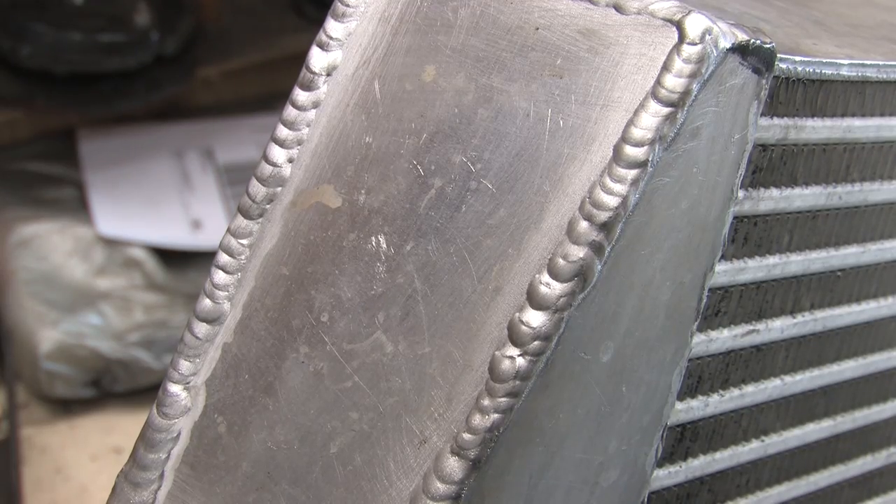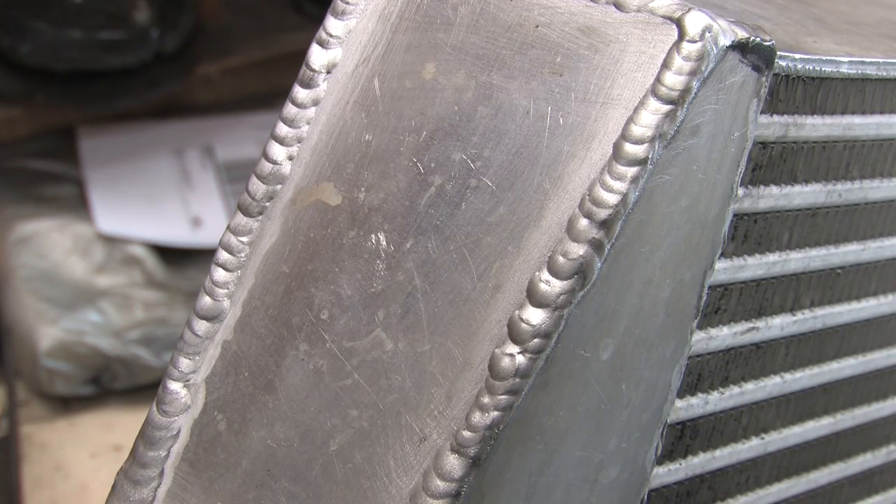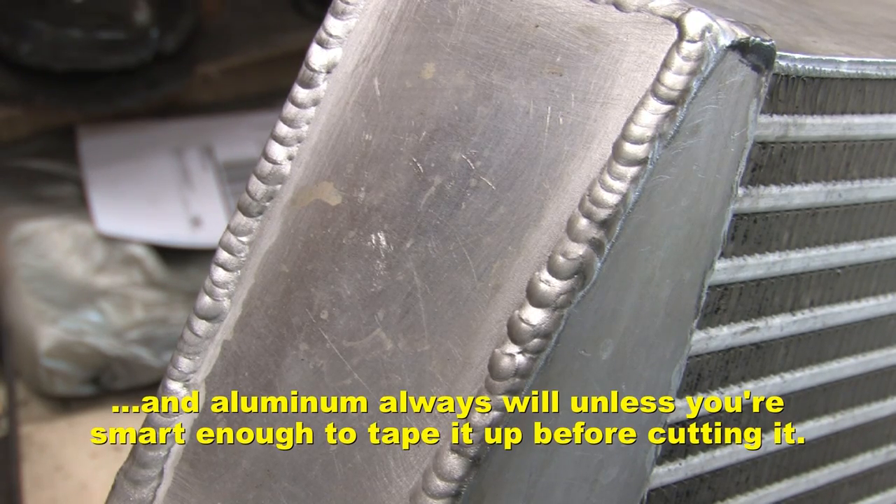The first thing is where to start. When you have a piece of aluminum that's marred up and you want to put a nice shine on it and get all the defects out of the surface, what you have to do first is figure out what grade of sandpaper you need to start with. A piece of sheet aluminum you can usually just polish straight up, but if it's been scratched up in the fabricating process, then you need to figure out where to start.